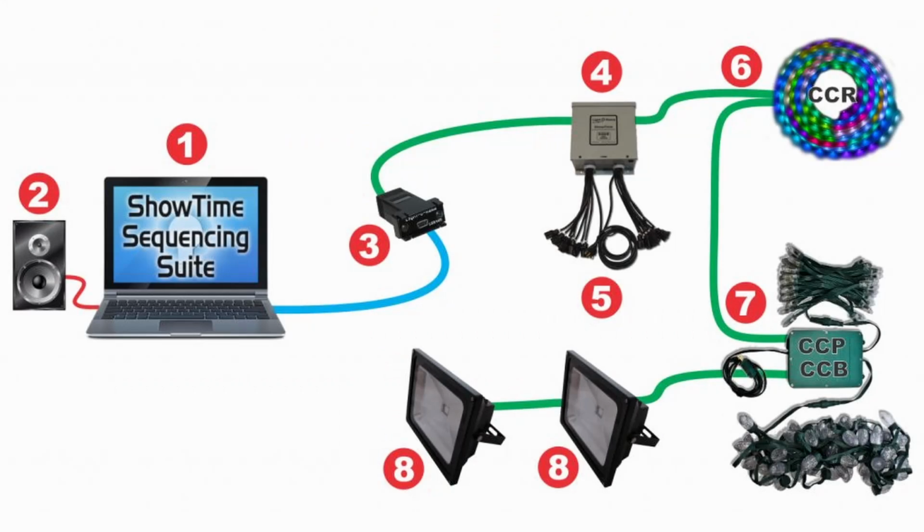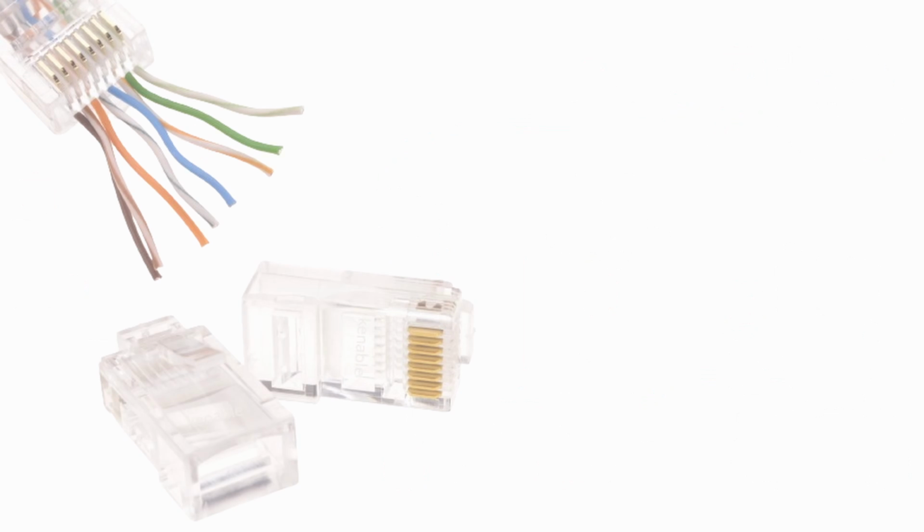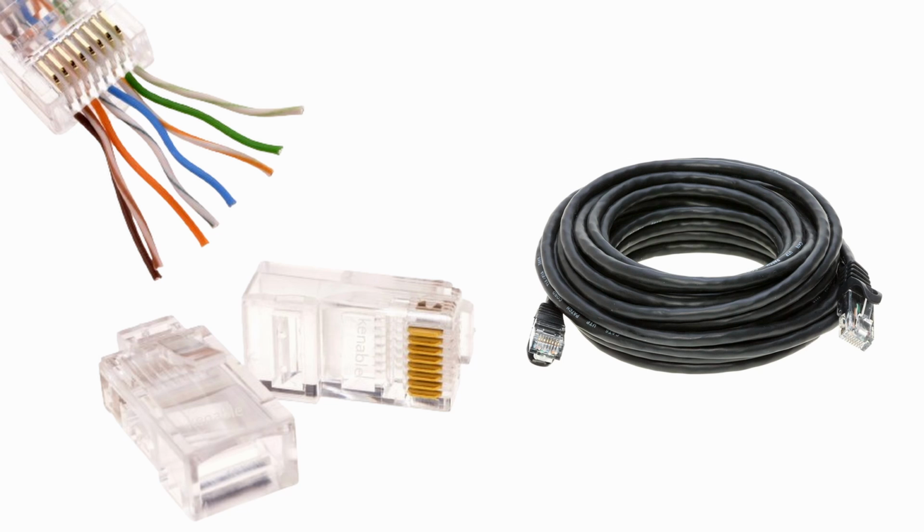You can use this information about the status lights to locate other potentially problematic Cat5 or Cat6 cables in the chain based on which controllers are able to connect. If you've made custom cables, especially over 100 feet, these are often the issue. Try replacing them with a purchased cable and refresh again in the hardware utility.